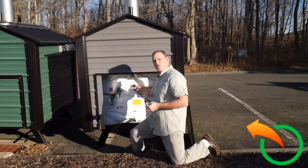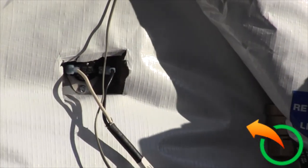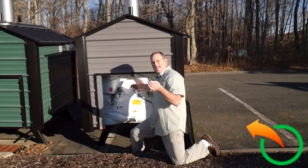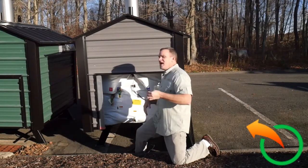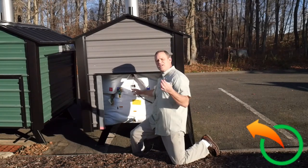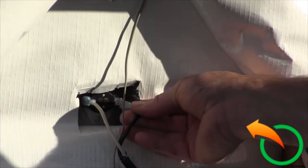These two 110-volt wires are going to it, connected as spade connectors. What also happens — and I've seen this numerous times — is over time the heat and the cold make the spade connectors fall off. People call me saying their fans aren't turning on, and I tell them to simply look at the spade connectors, and they notice that one of them is off. That'll make your fans not turn on.